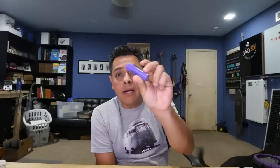Oh, and the other thing is, another cool, easy way is, what are you powering? A hair dryer. Okay, how much does a hair dryer use? Well, 1,500 watts. Okay, so in 1 hour, that's going to be 1.5 kilowatt hours, right? So you're going to need about 1.5 kilowatts per hour if you want to run that thing. If you want to run that all day, then you have to multiply by the number of hours. So how many batteries are you going to need? Well, if they're typically 10 watt hours, you multiply by that amount. If you need 10 kilowatt hours to run your thing for whatever amount of time you want to use it, you divide it by 10, and that's the number of cells you're going to need, right? So there are easy ways to figure that out quickly.